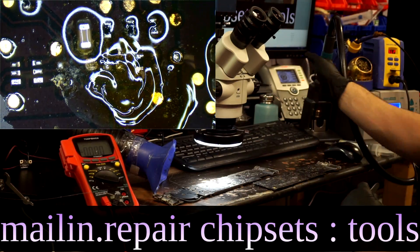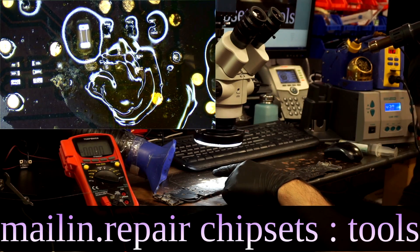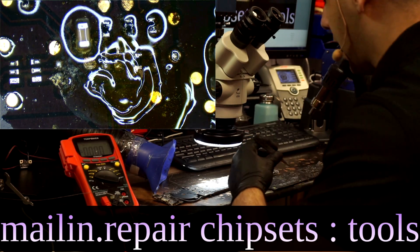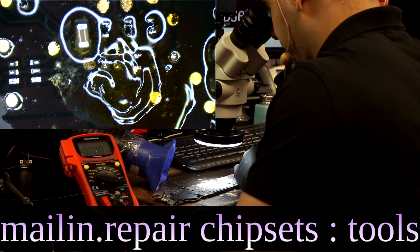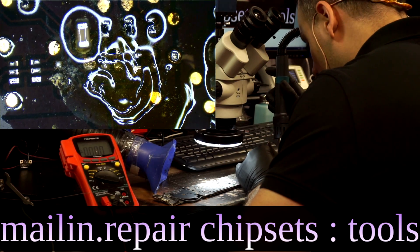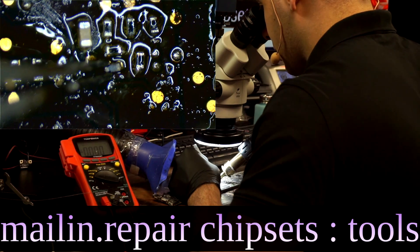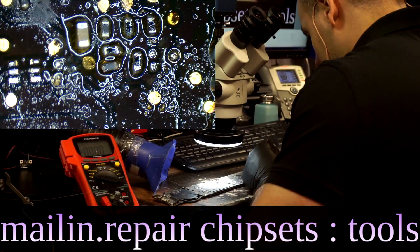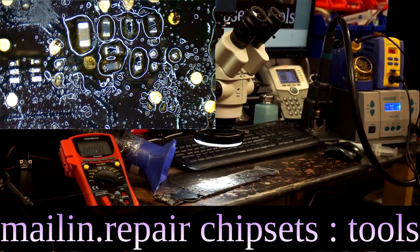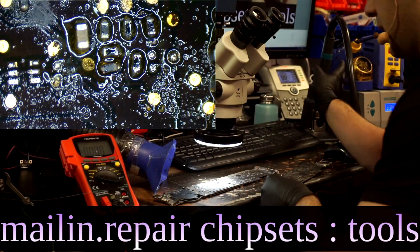One thing that I like to do here is I don't put the board that I'm stealing from under the microscope — I put the board that I'm working on under the microscope. The reason for that is, if I pick up this component and then I try to move this board under the microscope, whatever I have in my tweezers is going to fall. It's also not efficient if I'm stealing numerous components at a time. I don't really care about accuracy on the donor board because it's junk. If I happen to knock something off on the donor, I don't particularly care. That's something I care about on the board that I am soldering on.